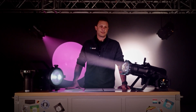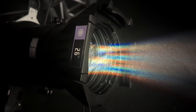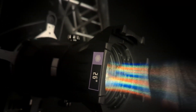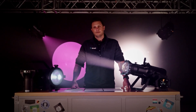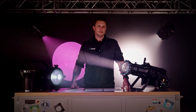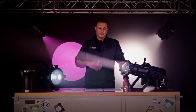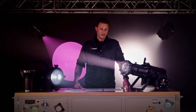The six color color mixing in the RGB ALC fixture is trying to mitigate that. The way we do that is by adding those other colors, particularly the lime. When you look at a conventional white light source, what you're really seeing is a pretty broad, even distribution over the entire visible spectrum of light. With LEDs, because they have very intense but very small centers of output, you end up missing quite a bit of the spectrum. So adding more different colors of LEDs will help smooth that out.